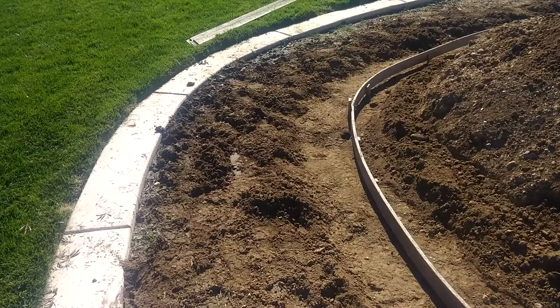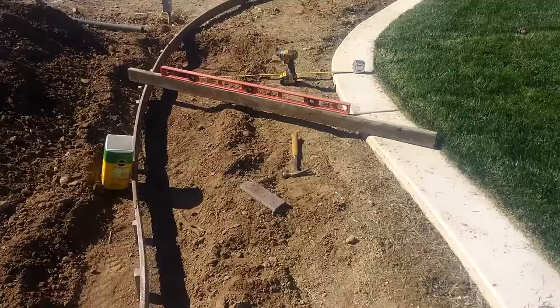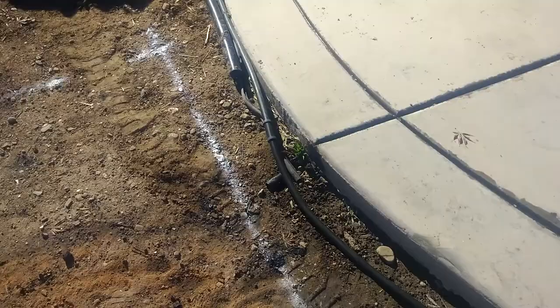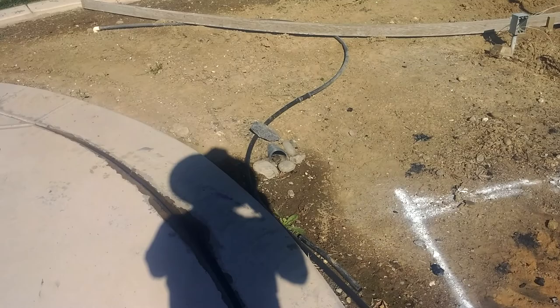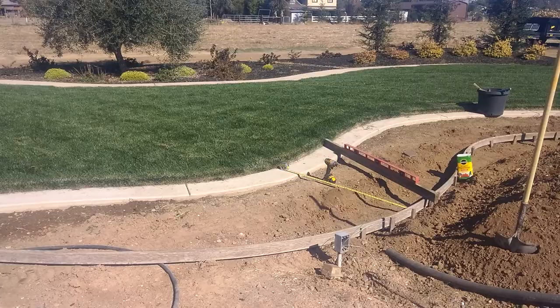On the outside, near the lawn edging, I'm going to V that out and put in gravel. It's going to be tapered so that it flows from the high in the back to the low in the front, and then it'll be caught and transferred out of here by that drain — and then that drain right there. This one goes across the way over there to a sump pump that's beyond the trailer. The other one, complete with frog, goes out into a French drain on the other side of the olive tree and gets some water in the ground naturally — so a little bit of a rain drain.